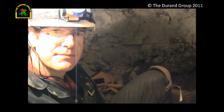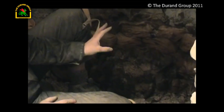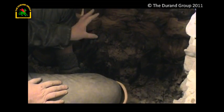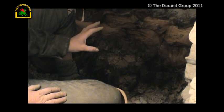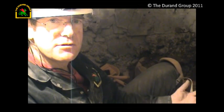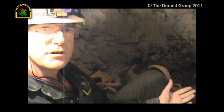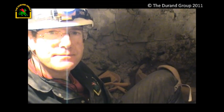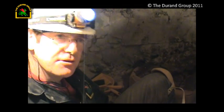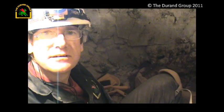Tell me about why it's necessary to do one-man risk. What we've got to take in mind is that this is explosives and what we have is explosive that is 90 years old. We've got detonators in here which probably have deteriorated quite considerably. We have gun cotton which again may well have deteriorated within the ammonium nitrate that's in the main charge. All these produce sensitive crystals, so the objective will be to take it apart very gently, but there is always that million-to-one chance that something might not go right, and therefore it's a one-man risk. So my instructions are? For you Andy, as soon as you've got this camera running for me, is to depart. I will give you time to get clear and then I will start to defuse this mine.